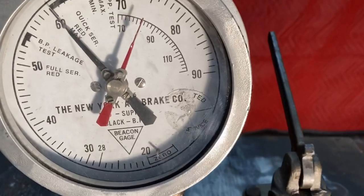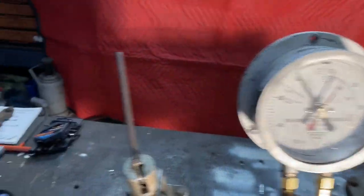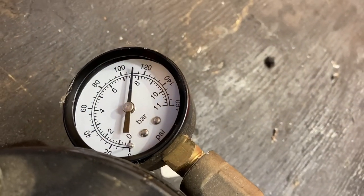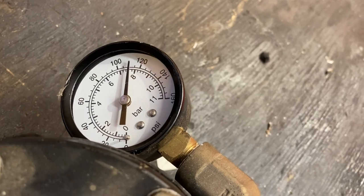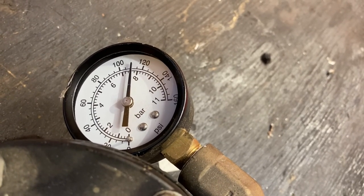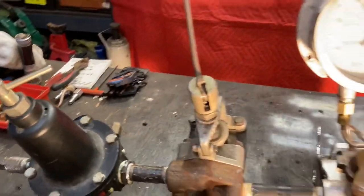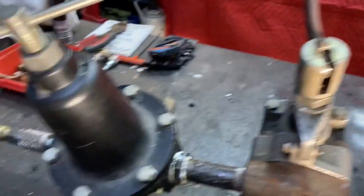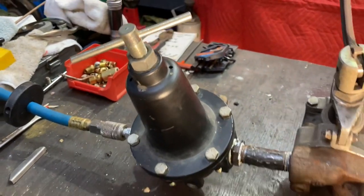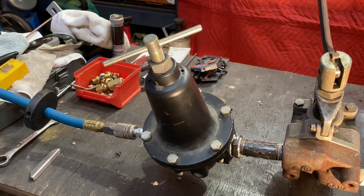The red needle is your main res, or your air supply. The air supply coming in needs to be at a minimum of 100 PSI. Right now we're looking at 110 PSI, which is fine. The compressor might kick on and should go up to 120. I've added this regulator — it's not particularly necessary, but I like to run it so that I know I have the right amount of pressure going in.